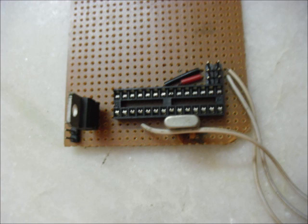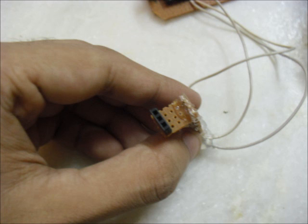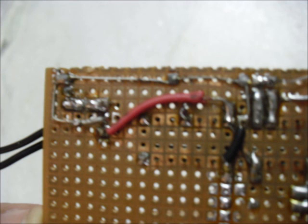Next I designed an Arduino clone on a piece of perfboard — you can easily find the circuit for this on the web. This is the mount for the ultrasonic sensor. It consists of three header pins soldered on a strip of perfboard, and three white wires running from it to the Arduino clone. I've used hot glue to stick pieces of perfboard in this shape, and I've also added some hot glue at the bottom of the stick to mount it to the CD. Here's the bottom view of the Arduino clone.